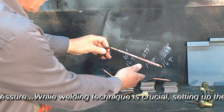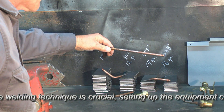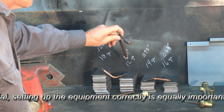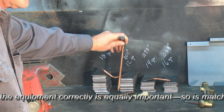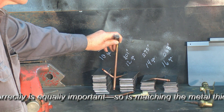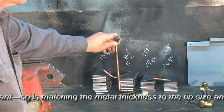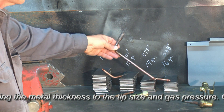The rosebud is interesting in that it says right on it: oxy-acetylene multi-flame heating assembly. Set the pressure equally — that would be 8 psi oxygen and 8 psi acetylene. The rosebud is used to heat metals for preheat when we're doing cast iron welding and processes that require preheat, or if we're just trying to thaw things out that are frozen or need heat — including things like Loctite 271. We can use the rosebud for that.